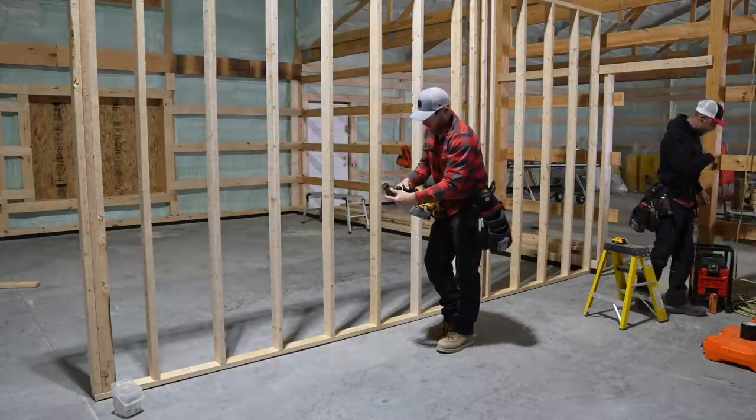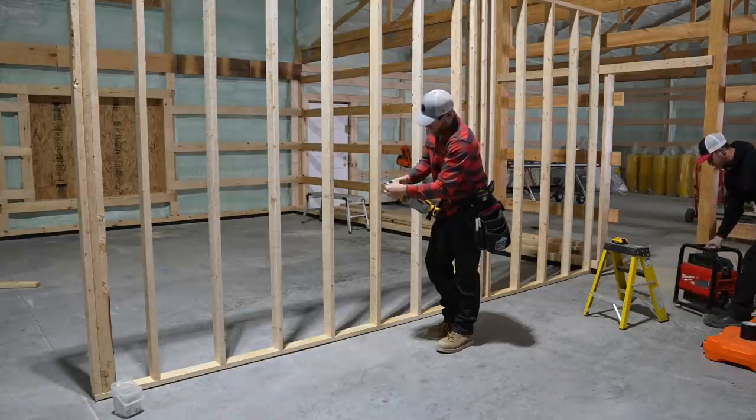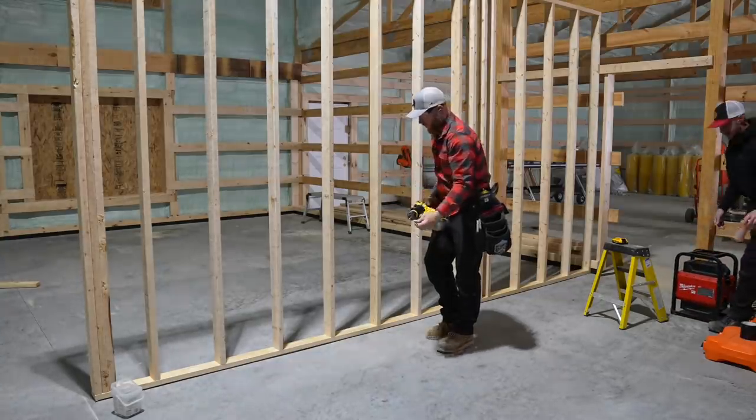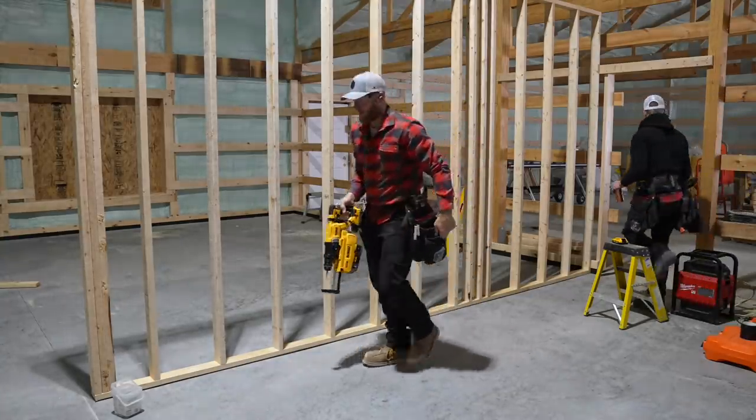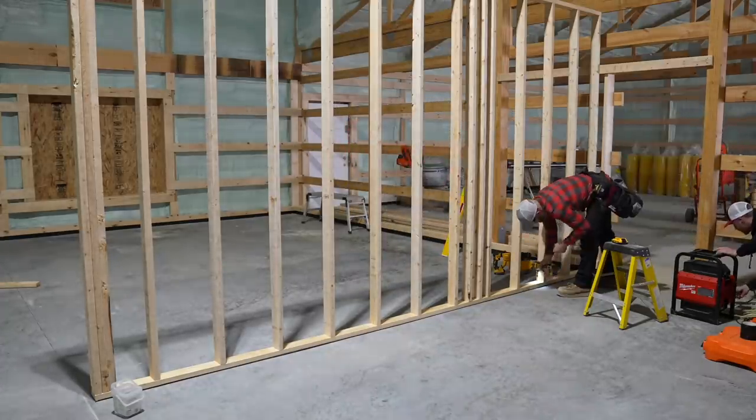So one thing I wanna do is make sure that my depth is set for the Tapcon. So we only wanna go a little bit deeper than the Tapcon itself. And think about it, the odds are always in our favor, right, Greg, I think?